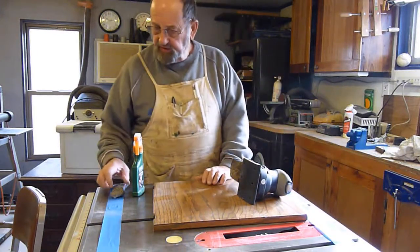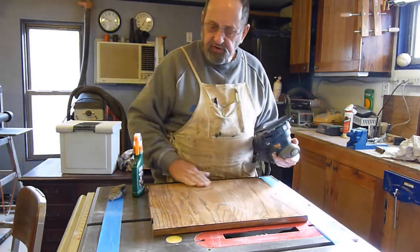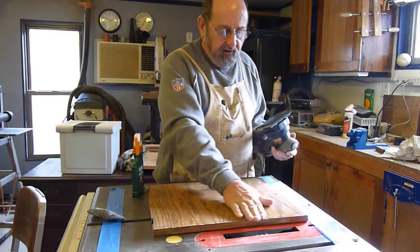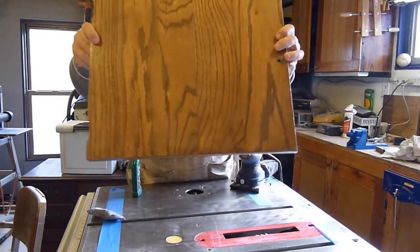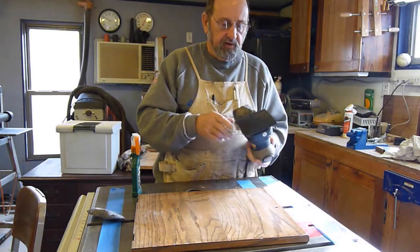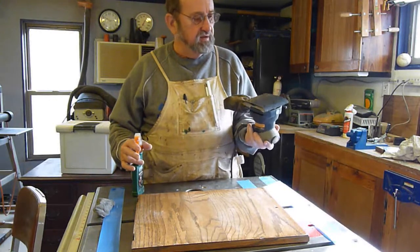Hello, it's Hallowood Meister here. I'm putting the finishing touches on this old secretary. I've got two coats of polyurethane on this. I want to give it a different sheen — I rubbed it out a little with the quadruple-ought fine steel wool and it still isn't smooth enough for me. I want a satin finish on it. So I'm gonna sand it down a little with this very, very fine wet-dry sandpaper. It's 500 grit — it goes all the way up to 3000 grit, which is super fine, but this is plenty fine enough.